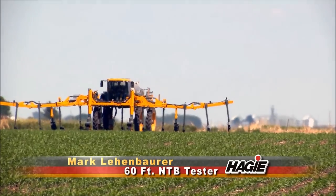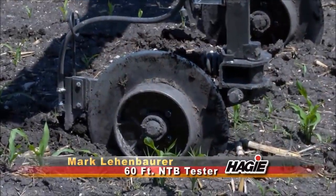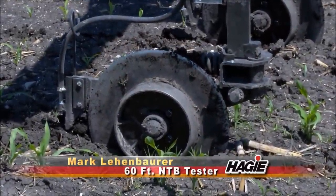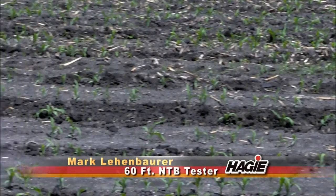is you're able to increase or decrease down pressure on the wings. We started out when it was really dry. We got one significant rain event while we were side dressing, which actually loosened our soil up, so I got the opportunity to run it when it was wetter. As the ground kept drying out you'd put more down pressure, then we got that one rain event and the ends were wanting to plow in and dig in. We were able to take down pressure off of them and get the bar running level again, watching the coulter depths so we weren't putting excessive down pressure on the coulters. Then as the ground dried back out we were able to slowly increase the pressure back up.